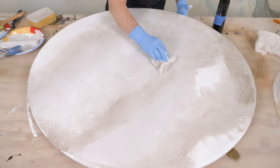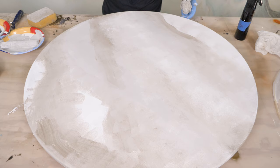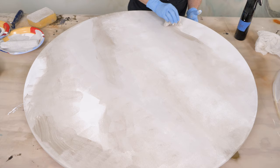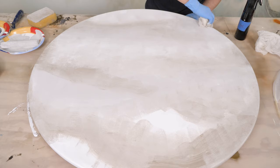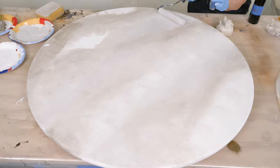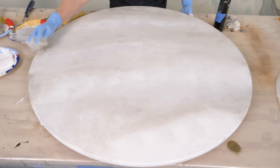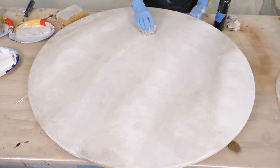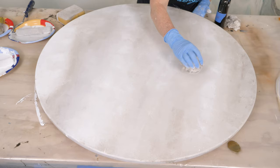This is a great finish if you want to do a pour in place — you create that design prior to pouring your epoxy, then all you have to do is pour on a clear coat. I can even get crazy and add a bold line if I want, and as I stipple, I'm just blending all of that in. There's a tool called a woolly — it's like a sheepskin — it really does a fantastic job. You can order them from Amazon or any high-end paint store. As I start to get the top where I like it, I can add more detail, and I love how it's looking over on the edge — very textured with a little bit of that striated look.